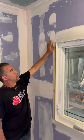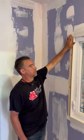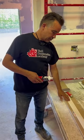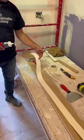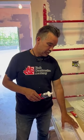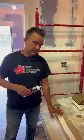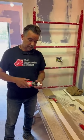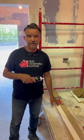I'm about to show you the taping method to use with this technique to ensure good adhesion. I recommend paper tape versus fiber tape to minimize cracking. Unlike a normal situation where you'd use drywall compound to set your tape, you want to use an adhesive that ensures good adhesion to the MDF jam extension and the drywall. Today we're using No More Nails, but I've used carpenter's glue in the past with great success.